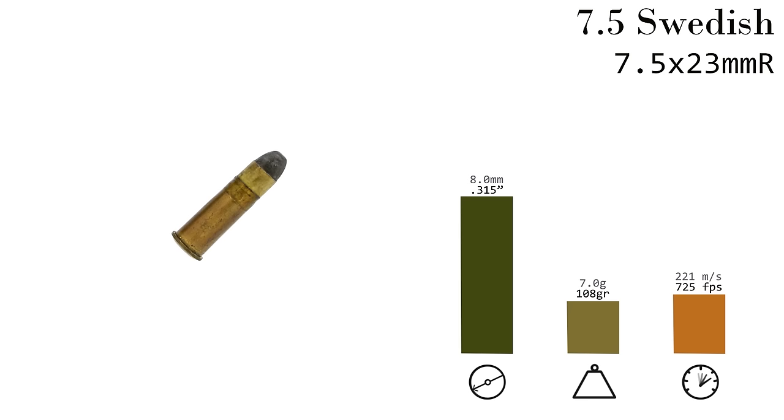The improved cartridges at a distance of 35 arshin were able to pass through 3 1-inch boards. Half on average would actually clear 5 boards, that's 2 more than the best of the old Smith & Wesson 11mm. Even at 200 arshin, they would still clear 1 board. The Nagant was also compact and light and far more convenient than the Smith & Wesson, though they felt it still could be lighter, and there was some sign of cylinder jamming, likely on the release of the trigger. There were also issues with the firing pin, light strikes, and binding. 25 examples were ordered for testing.